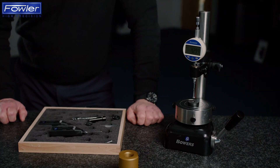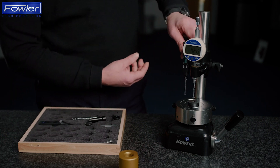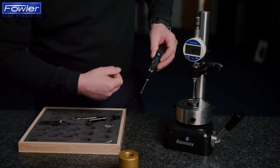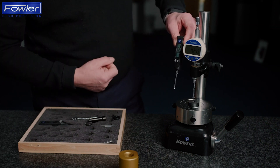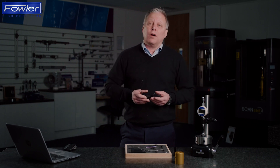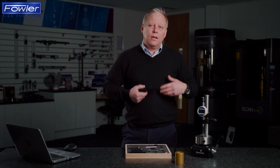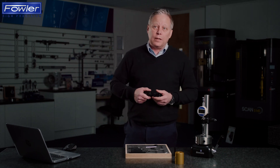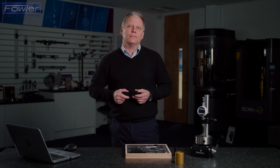For large batch or repetitive measurement, we can even automate this process using the same micro gauge head, but with an adapter. I've used one of the standard Bowers indicators, because as I'm sat in front of that comparator and operating it, I want to be able to see the display horizontally. So if you're using pin gauges, or for that matter any other go/no-go or attribute style gauging, then take a moment to calculate the cost of managing that inventory, keeping it in calibration, replacing it as it wears out. And then give Bowers a call, and let's see if we can show you how quickly a system like this will pay back. Thanks for watching.